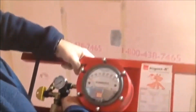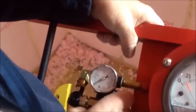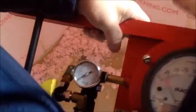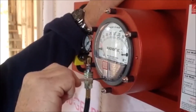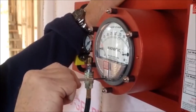Inspector Gauge Calibration Step 1: Set the Inspector Density Gauge to 10 PSIG. Step 2: Hold the gauge in the vertical position so that you are looking at the large dial. If the needle reads zero, proceed to the next step. If the needle is more than one bar from zero, use a small screwdriver to turn the screw on the face of the dial and adjust the needle to zero.